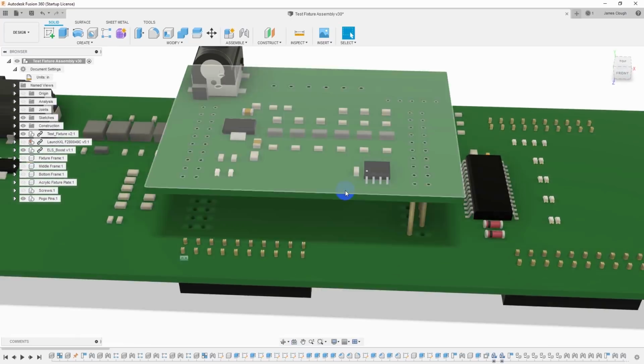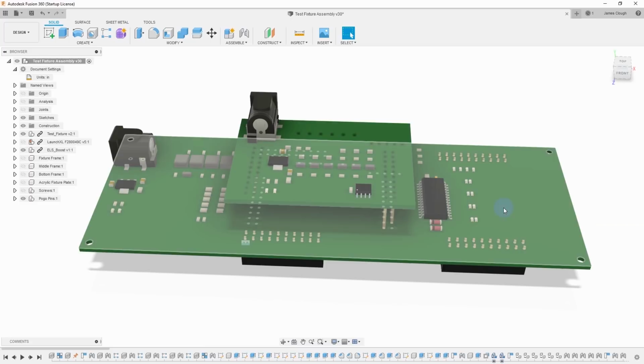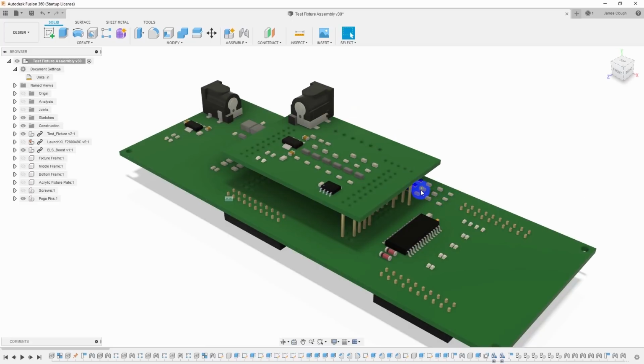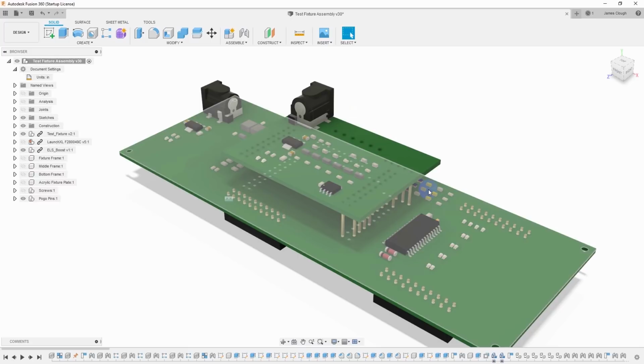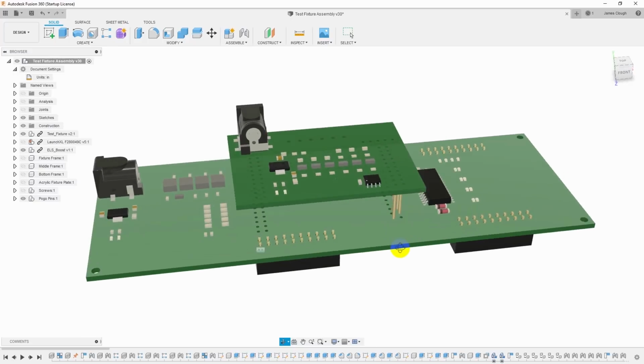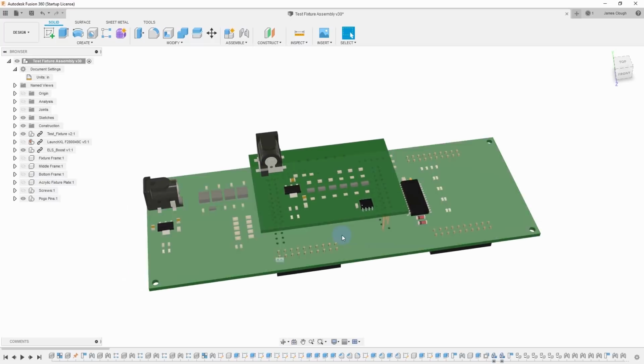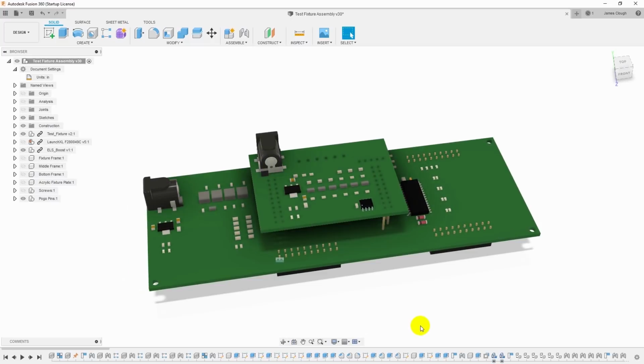the board. Then this board underneath actually has a display output driver, the same as the one that is going to be used in the actual electronic lead screw. It's got a network of components of inductors and capacitors up here to simulate the cable that will connect this board to the display, so I can verify two-way communication with that. It's also got optocouplers on the board that can simulate the inputs and outputs for the servo or stepper driver, and it's got a bank of resistors to simulate the load of the external microcontroller so that I can actually test the voltage regulator as well.